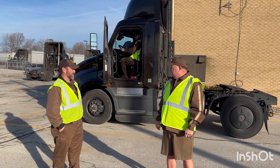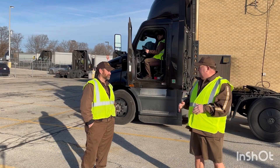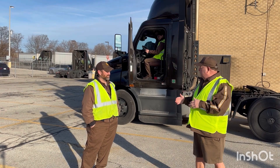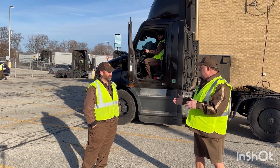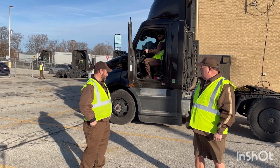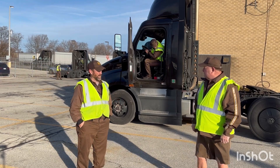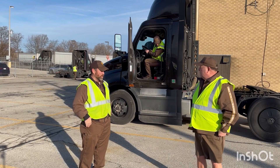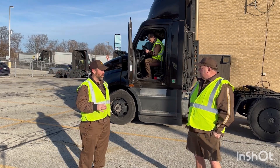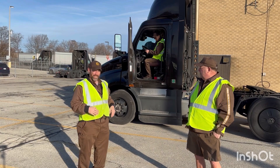When you're getting back out of the tractor with three points of contact, is it just a reversal of what you were doing before, or are you doing something different? It's similar but not exact. The first thing I'm going to do is look down on the ground before I step out. I want to make sure there's no debris, no uneven surfaces, nothing that I can step on that's going to twist an ankle or get me injured.